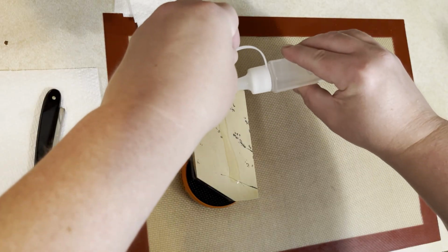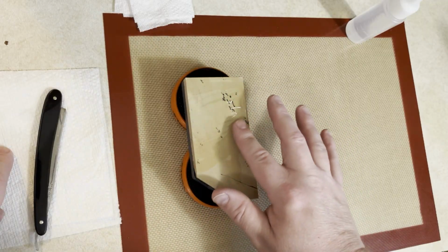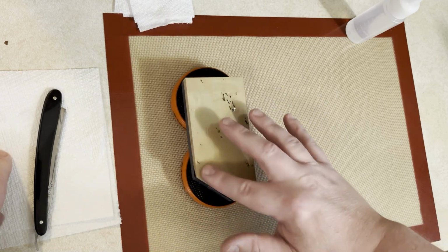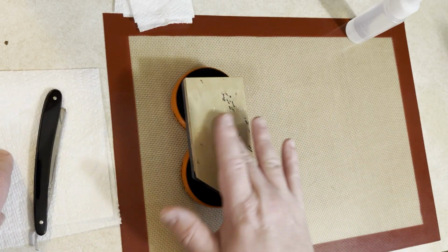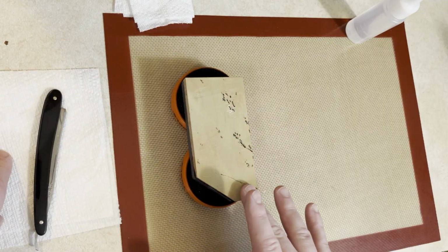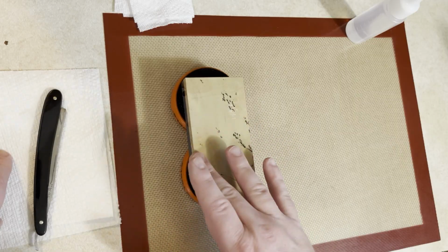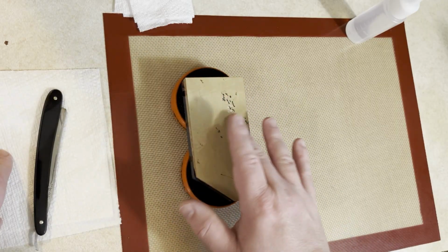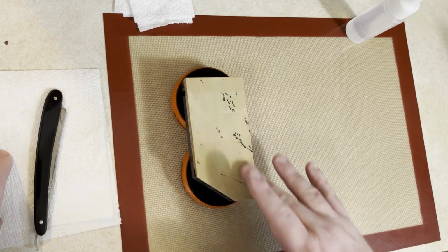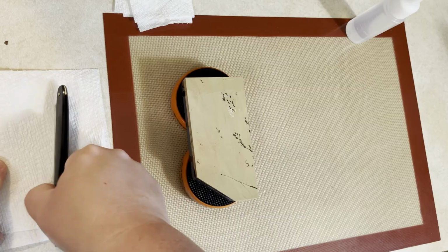This is just baby oil. It's what I like to use. Some people use like a 3-in-1 or I don't know, some people use glycerin or whatever floats your boat. To prep the stone, since I was using a diamond stone, the diamond stone will shape the honing area and the grains of the stone differently. So I went ahead and lapped it with one of the slurry stones, rubbed it around really good to properly shape the coticule granules to get it ready for honing on oil.